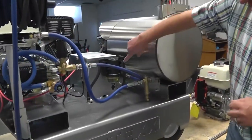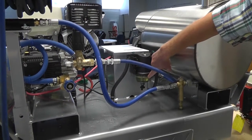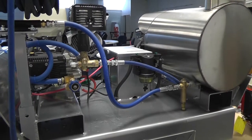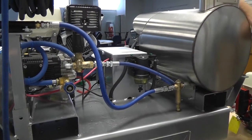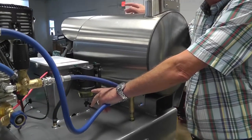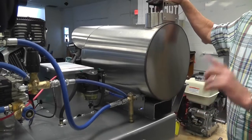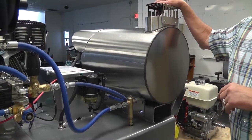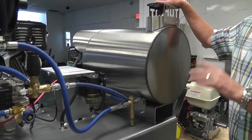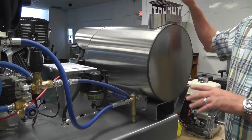You can see how this fuel filter is full of fuel. If there's air in that filter, that means there's no fuel in the tank and you're not getting fuel in the system, or the burner is not kicking in. Most times when you refuel the tank, one startup will suck enough fuel through it and start it burning. If it doesn't, shut the switch down, hesitate for a few seconds and start it again. It should start pumping.